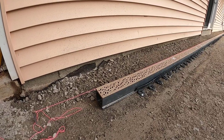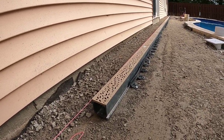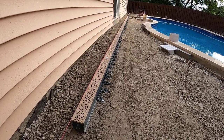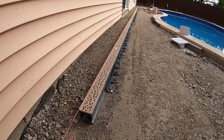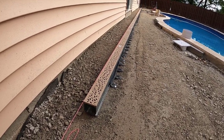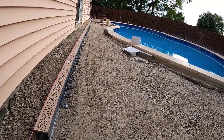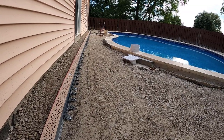I jumped forward a bit, but I'll go ahead and show you exactly how I got the channel drain installed. It was just easier to get it in first and then explain my approach. All the channels got glued together — definitely let them set up before moving them around; they don't set as quickly as schedule 40 PVC even though they're PVC using heavy-duty cement. We spent time getting the grade set: they're beside the pool, fairly level but pitched away from the pool coping — a little over a half inch lower than the coping.